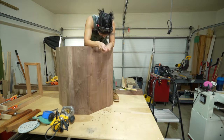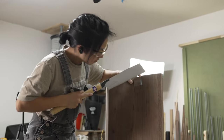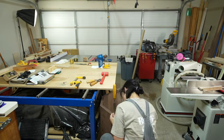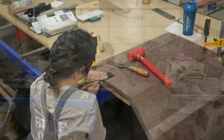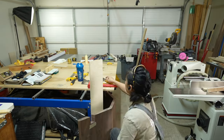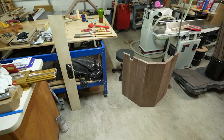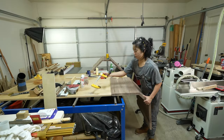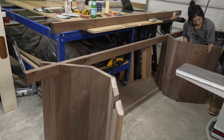These batwings had two specific complications. First, they are positioned at an angle, so even if I laid them down on the workbench to chisel, I could only go so far before needing to put them back into an upright position. Second, when in a standing position, I have nothing to clamp them tightly against to establish stability. I eventually figured out to butt the batwing against the workbench leg, with a piece of plywood between them so I wouldn't accidentally damage the chisel. This hand tool portion took me a long time, and I felt like I'd aged about 10 years - but eventually, I got it done.